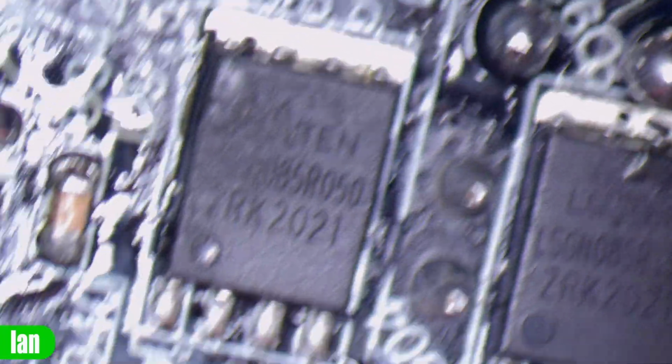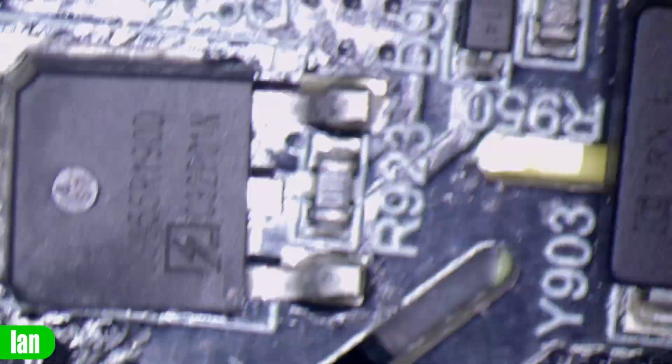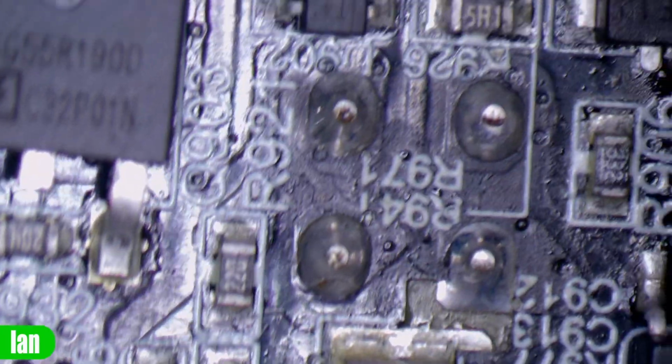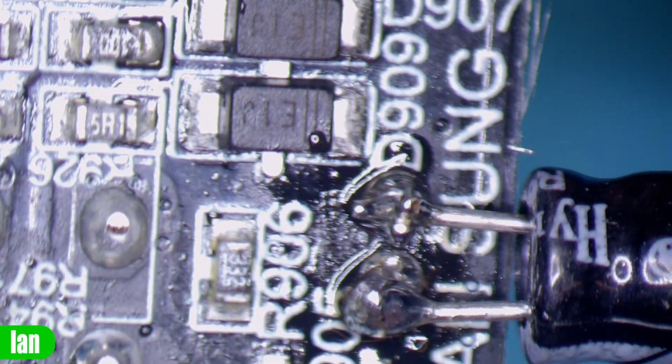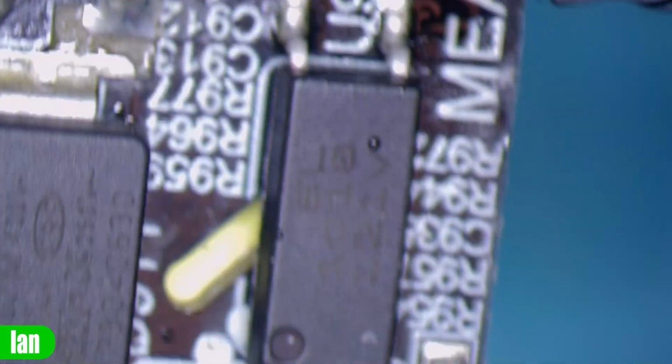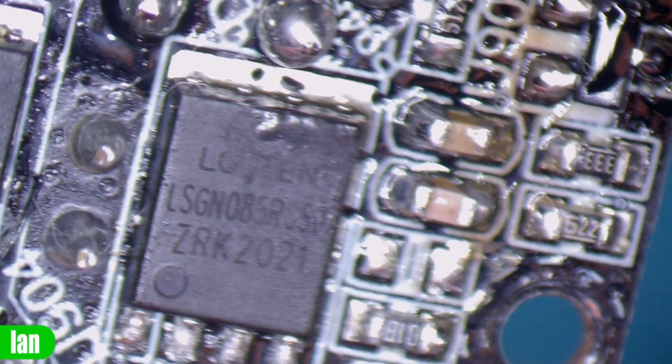And then if we just hop over to the AC board, just to give you a look at that. Again, see some flux residue on the board, some FETs. The AC board does look a little bit rougher than the DC, if I'm honest. The DC board looks a bit better made. You can see that additional capacitor there. It's not bad, but it just looks a little bit messier, if I'm honest. But it is also coated, so it could be the coating that's doing that.